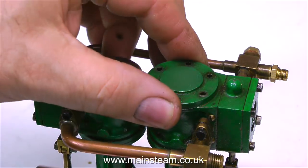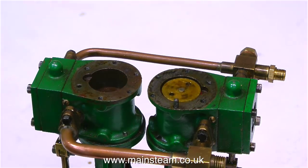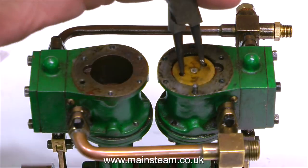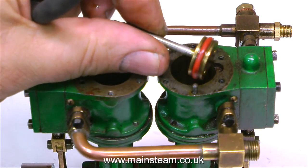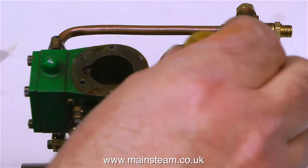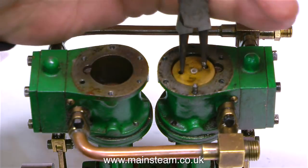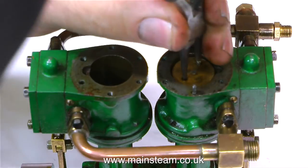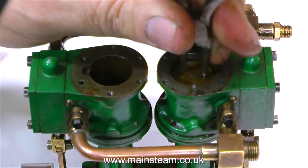The good news is none of the bolts are sheared — one of them is a stud, but I can live with that. Here are the pistons. The holes drilled in the top allow a pair of circlip pliers to undo the pistons — they're not drilled in the right place, but such is life. I took these out a while back, fitted some silicone piston rings and put them back in. If you pull a piston out of a cylinder and the O-ring is all flattened and squared off, that means the O-ring is putting far too much pressure against the cylinder wall — it should remain quite round even after running. You can get tables showing clearances and tolerances for fitting O-rings from the manufacturers, or you can look in a Zeus book — Z-E-U-S, as in the Greek God. A Zeus book is a very useful thing to have in the workshop.